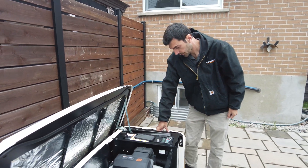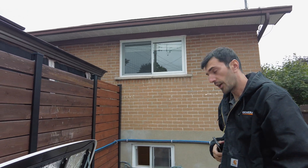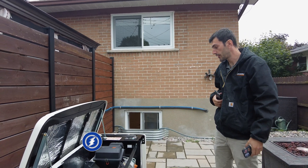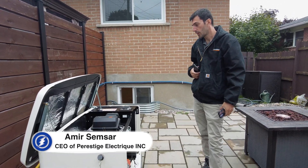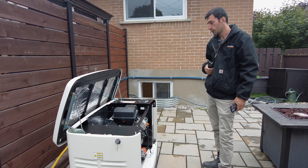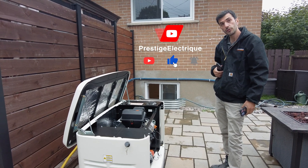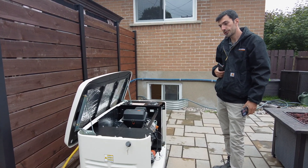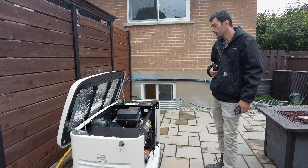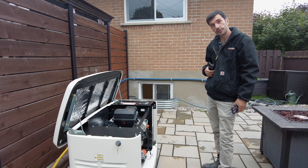This is a 14 kilowatt air-cooled unit. The maximum amp it gives us is 60 amps — we definitely don't want to run at maximum all the time. So we consider 80% continuous consumption, which brings us to 48-50 amps. It's doing more than essentials: some lights, fridge, freezer, plus a couple of baseboard heaters. We are able to put all these items on this size generator. The installation is done.